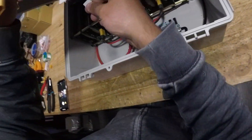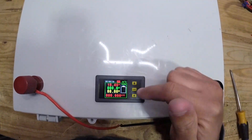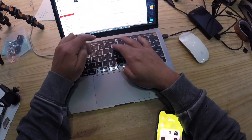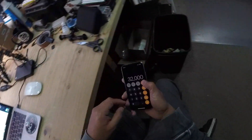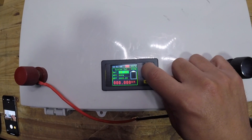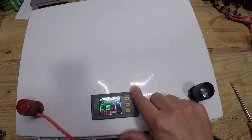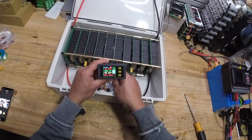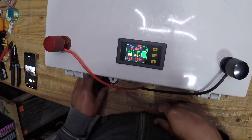The next thing is to connect the battery meter. There are 10 cells at 3,200 milliamp hours each from batteryhookup.com, giving us 32 amp hours total. Let's adjust the meter settings — we'll skip the over-power protection relay for now. There we go: set to 100%, 32 amp hours. Now it's accurate — 32 amp hours at 13.43 volts. Let's put a load on it.